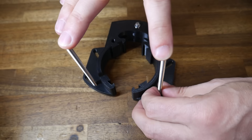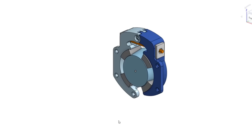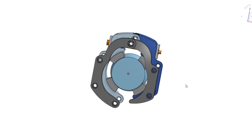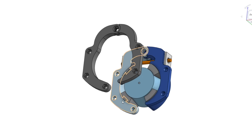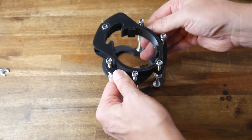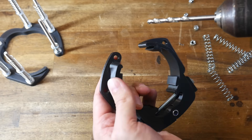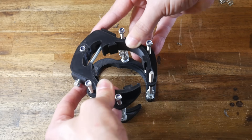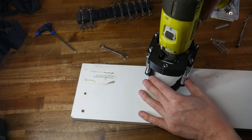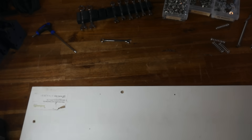Version 2 has fixed holes going around the clamp because the foot also swivels in the middle, meaning the two can pivot in the same way and keep everything aligned. One of the bolts won't have a spring — instead it will have a nut that we can rotate to act as a stop, pressing on the frame. I did manufacture this one, but it had major binding issues. It was really hard to get the long screws square compared to the foot, so I loosened and adjusted these, as well as expanding the holes on the other side. This improved things quite a bit, but it still wasn't anywhere near smooth enough. I confirmed this by installing it onto the drill and having a test run — as downward pressure is applied, the drill can wobble from side to side, meaning we're not necessarily cutting straight. My two test countersunk holes were pretty much the same depth, but it still didn't inspire confidence.